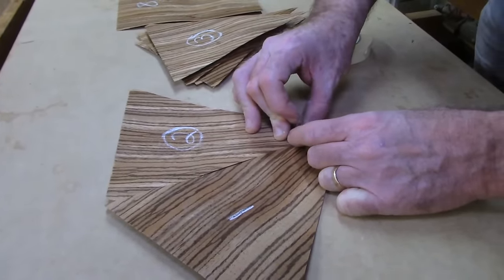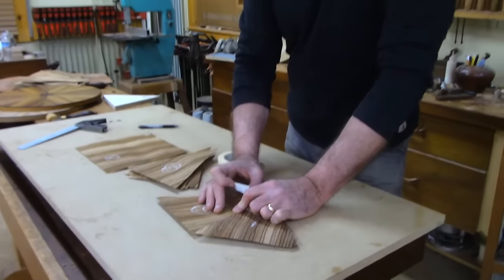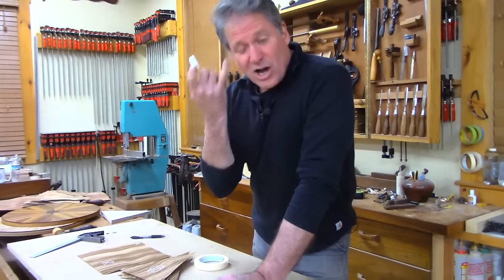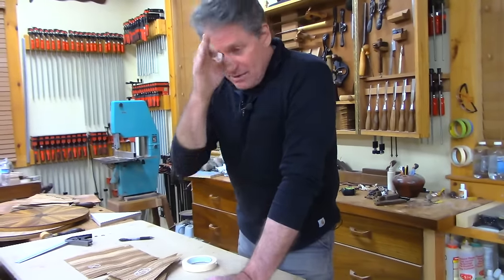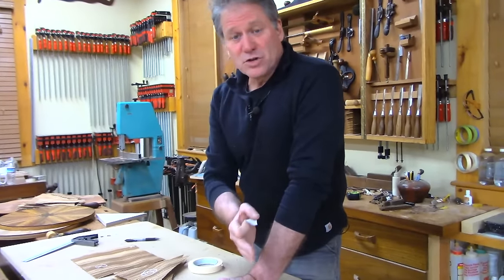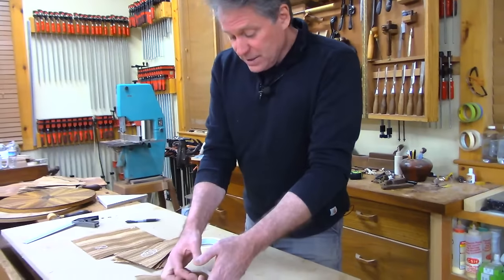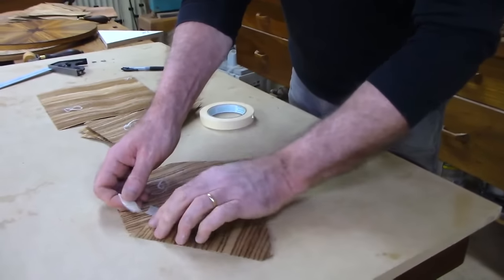Carl is asking: is there a reason you're only doing them one at a time instead of stacking? If you stacked them, you'd have to align every one perfectly over that notch, and since these are bubbly you wouldn't get a nice saw cut — it would start to fracture. You're really good for one saw cut through at a time. There are methods where you can sandwich veneer between two pieces of plywood and if they're truly aligned run a saw or router down it, but for good quality and accurate dimension, cut one at a time.